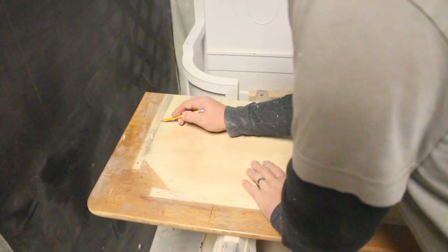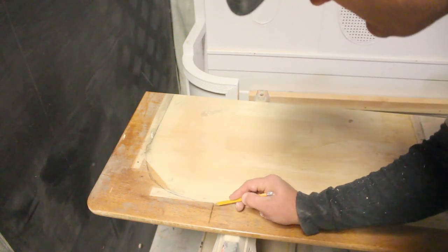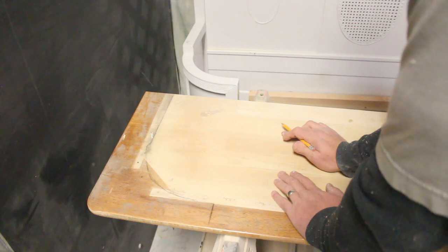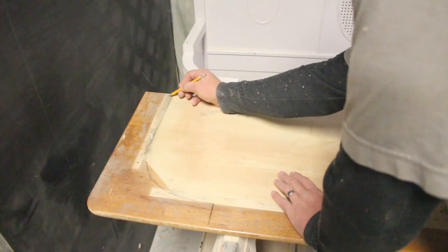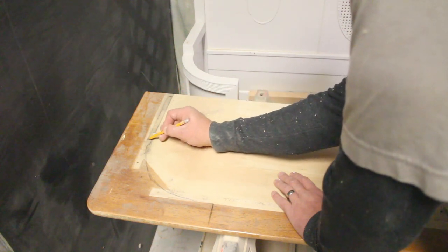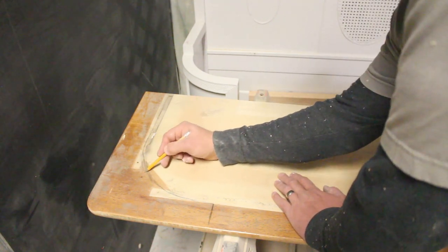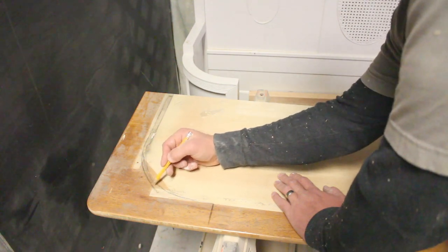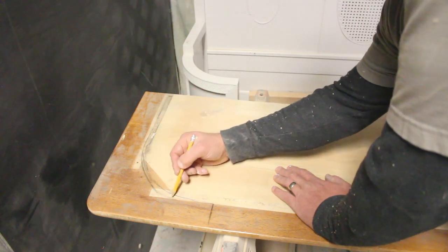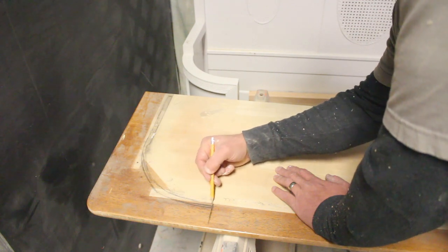You can see my line here kind of tracing around, and then it takes a little jump. I'm going to get this nice and dark so I can see it good. And then this is right here in the front where that pokes out and intrudes. Now in the back on the bottom there, there's going to be a cutout, so I need to account for that and come out probably about half an inch on each side. I'm just going to eyeball it on that part there — maybe go half an inch all the way around. Once I've got my basic shape, I'll cut out the exact spots that I need and start cutting those notches out as well. You always want to go a little bigger so you can trim down more later and fit it in nice and neat.